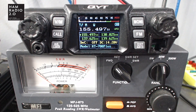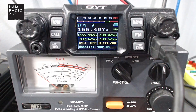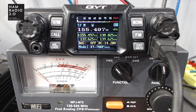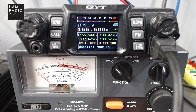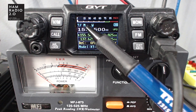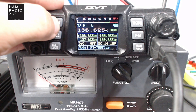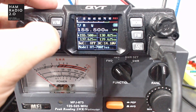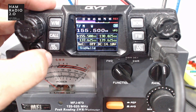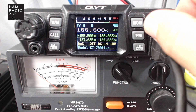Maybe it'll tell you if your car battery or power supply is low. Right under it there's an RJ45 plug for the microphone. In the green text beneath the VFO you can see 155.497 — that's the VFO display. M is presumably medium, W is presumably wide. There's VM for VFO and memory mode, a Call channel you can set, and the display turns purple. It also has High and Low power settings.